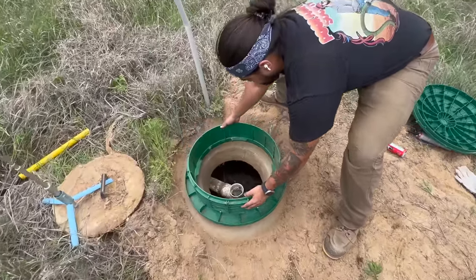Successful riser install and this thing ain't going anywhere. That's the inlet side — we're going to work our way over here and do the outlet side now. I generally advise risers on both lids, but if you had to pick one, definitely pick the inlet side. This is one of the most important parts of the septic tank to have access to. If your septic tank is ever backing up, nine times out of ten the clog is right here in this inlet baffle. Most of the time that's due to needing to be pumped — a severely thick floating scum layer. If ever you're backing up, you could pop this open and use a stick to push that down until a septic pumper is able to come pump out the tank.